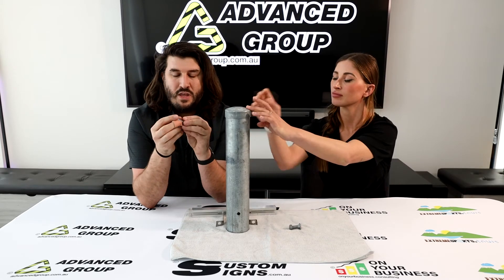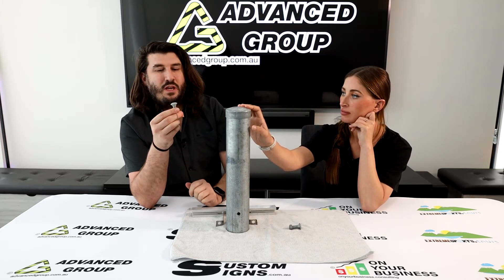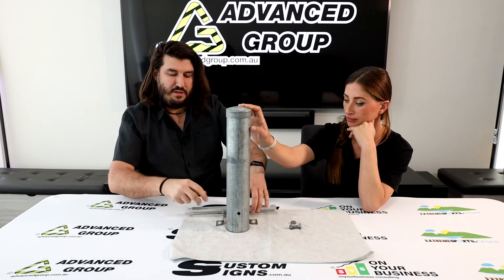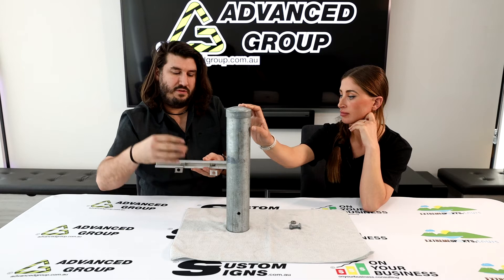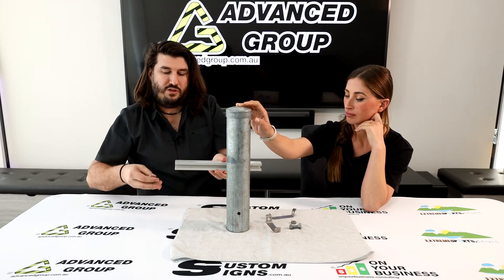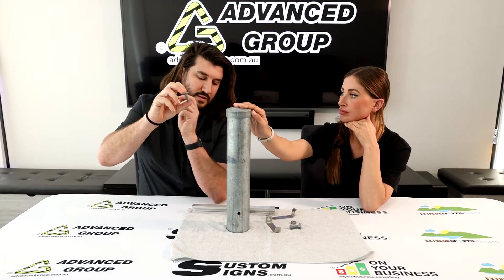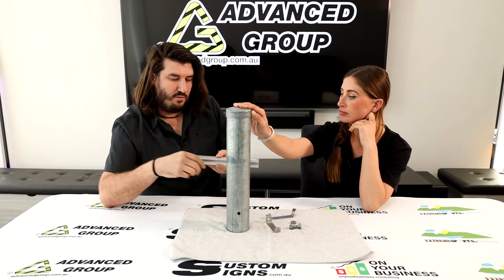These are a cup head bolt — some people might call them a coach bolt, and technically you could probably use either term. There is also a thing called a mushroom head bolt, but this is more commonly called a cup head bolt. This is designed so that if you've got one piece of strut on the back of one sign, and the other sign also has strut channel, these cup head bolts can slide in here. Because they've got a square profile part on the shaft, the bolt can go into the channel and not be able to twist within the strut channel.